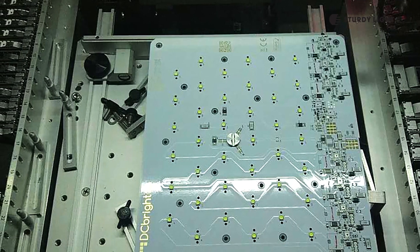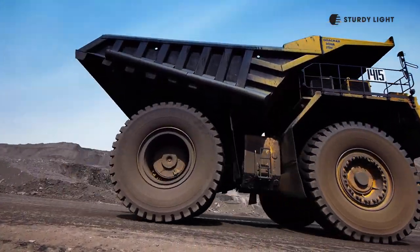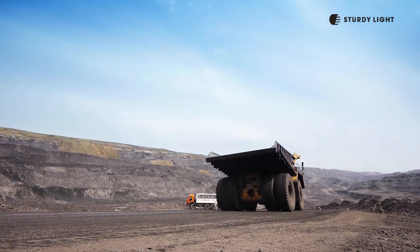Well, a couple of points we should look at with the circuit boards. Firstly, our circuit boards use a copper circuit board over and above the stamped aluminium circuit board — that's for heat dissipation, which we'll talk about a bit later. But one of the things that we do is, when we put the components on the circuit board and it's gone through to the vapour phase soldering, we then put an adhesive — and it's a special adhesive because you have to use the correct adhesives on the circuit boards — onto all the heavy components. Because even though people say solid state, it's not going to vibrate off, with the inertia and the impact that a lot of the machines have, there is potential for a heavy component to shear off. So, anything that's got a potential for failure like that is actually glued on there with a specific glue.